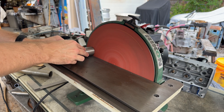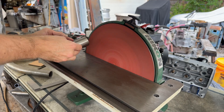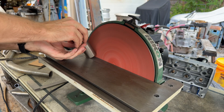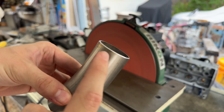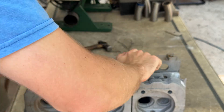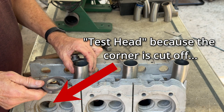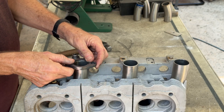After doing that, I had to sand the tubes to the final length and squareness. You can see that some of the tubes are really far off of being square, and once they are square, I add a little chamfer to the edge where they press into the head. With all the tubes to length and square, we can now do a trial assembly with the tubes, flanges, and tabs in the test head. With the tubes in place, you determine their rotation to make sure the flanges are close enough to the tabs so that we can actually weld them.